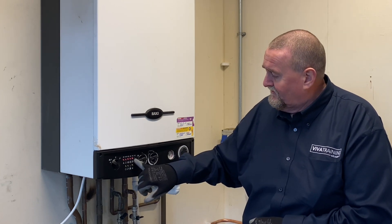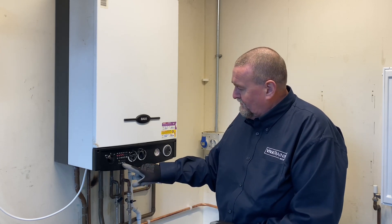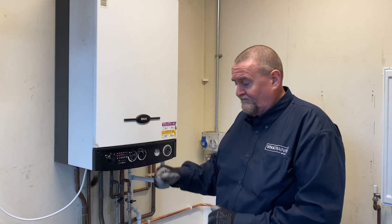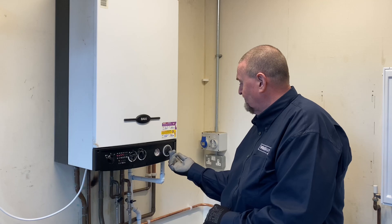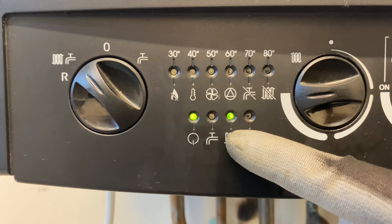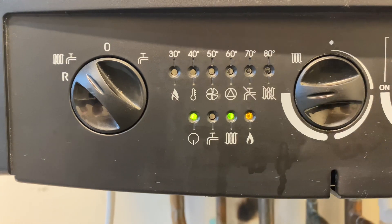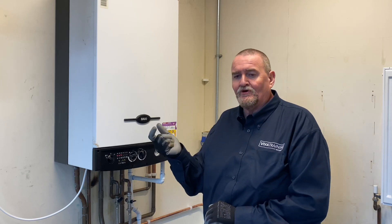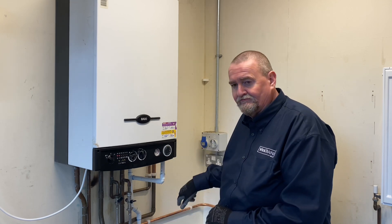Once we get up to 80 degrees, the preheat will go off because it's done its job. The radiator symbol on the bottom is obviously the heating. This boiler has an integrated time clock - putting it onto continuous, the little green light tells me I've got a central heating demand. The flame light comes on and we've lit up, now moved over onto heating. With a motorised diverter head, that motor has activated and moved the valve to allow water around the radiators.